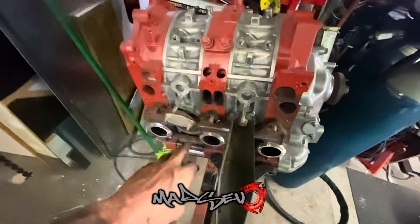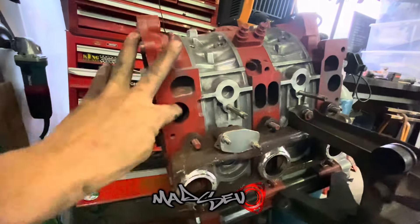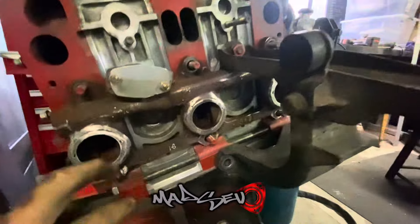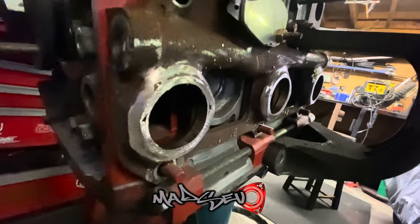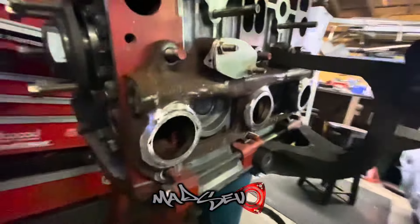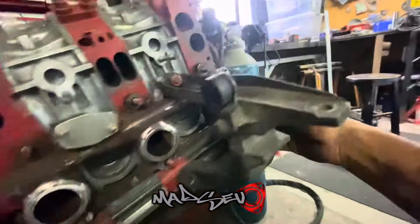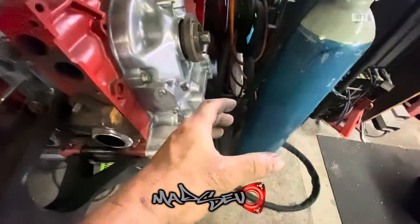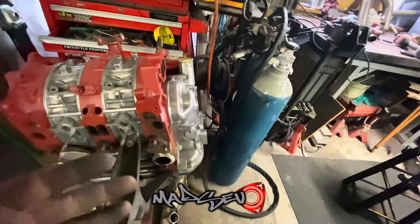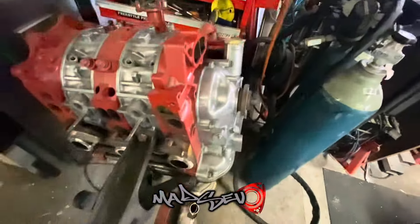She's cleaned up somewhat. I've got it sitting back on this engine — by the way this isn't a dummy block, we just haven't gotten around to rebuilding it yet. There are no rotors in there at the moment, it was just a mock-up for the front cover and sump. What I'm thinking is I'm going to build something that bends out that way, runs through the bracket, then runs up to about here, and then I'm going to v-band it and leave it at that until the engine's back in the car and I have a turbo. Then I can size up the rest, sit the turbo where it needs to be, and put braces back to the block if needed.